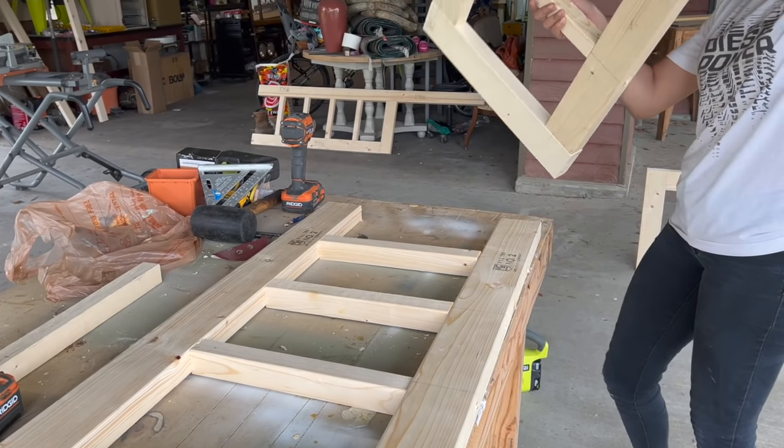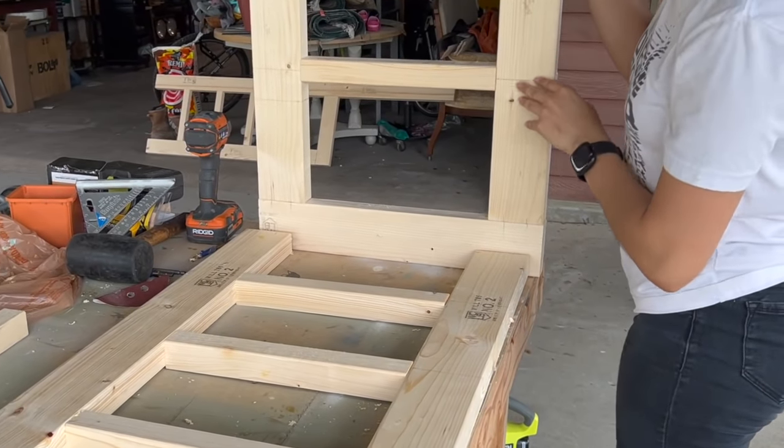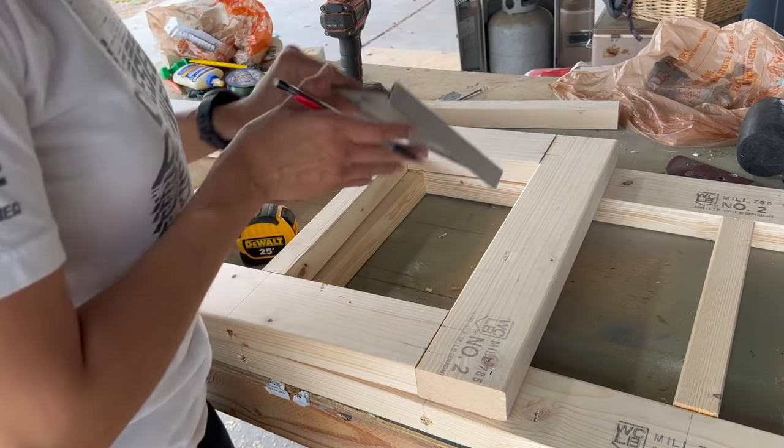The side panels I used the same marks, but they went on the face of the panel like this. Keep in mind that one of my side panels, the right one in my case, would only have one set of holes for dowel pins since the opening of the bed did not require a top set.